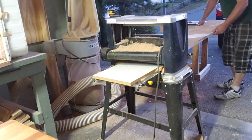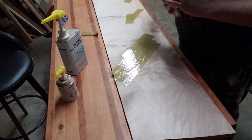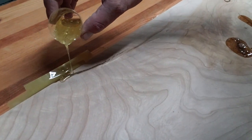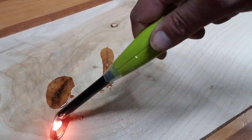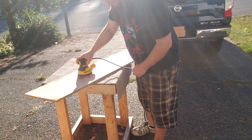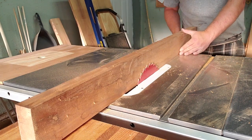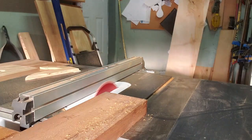I skip planed it to see what kind of wood I was working with and how much I needed to take off. I did take a hand plane to bits of it to thin out areas because it was fairly twisted. It was about a five-quarter piece of maple that I had to take all the way down to about five-eighths to get it flattened out for a tabletop. Then I taped up the underside of the slab and filled the cracks with West Systems epoxy, using a barbecue lighter to heat it so it sinks into the cracks and pops the bubbles. I filled those cracks maybe three times plus sanding in between and always had little gaps left — it was my first epoxy crack fill and I should have just grabbed a new piece of wood.